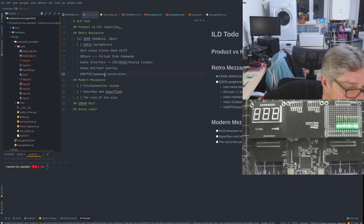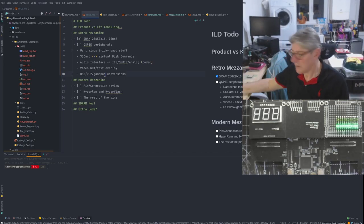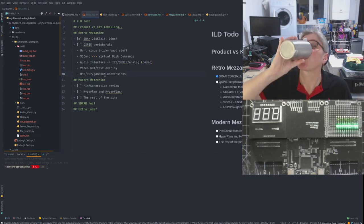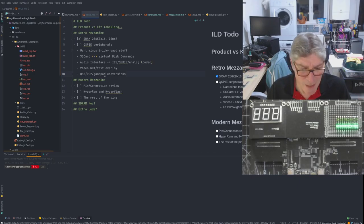Laurie, they have their own serial protocol. The ones with the 9-pin connector use the Nintendo protocol. Esden did a PMOD for those. So we could either go the PMOD route for those, or you could even do it through the STM32. I'm not sure how much benefit you get by going through the STM32, other than saving yourself some tile space.